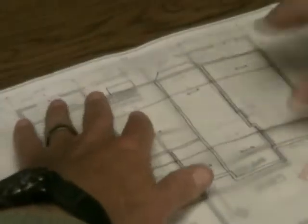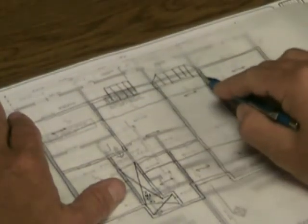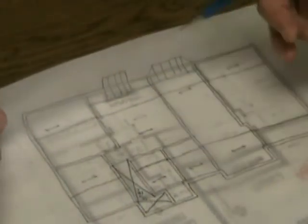When it comes to the cantilevered portions up here, we're not going to cover that in detail in this course. We know the floor joists will need to go in this direction, cantilevered over the bearing wall at this location, with probably a single or double joist on the back side to create the cantilever condition. For the purposes of sizing joists, we'll size them based on the conventional spans, and whatever joist we pick will end up being used for these cantilever conditions as well.